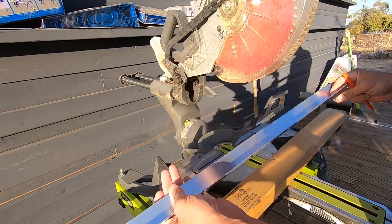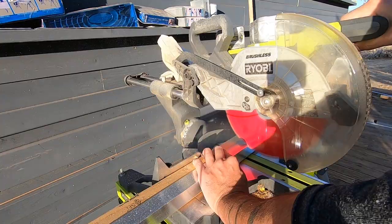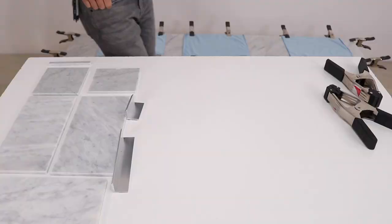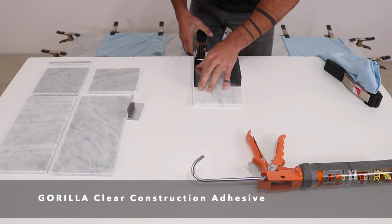To reinforce the connections I'm going to use some pieces of aluminum angle section, and I just cut these with my compound miter saw. You can cut aluminum on a saw like this as long as you just go real slow. These pieces of angled aluminum are just going to give me a little bit more surface area when I glue the pieces of tile together, but I'm going to start by gluing the aluminum with Gorilla Clear Construction Adhesive and just glue them right to the tile.